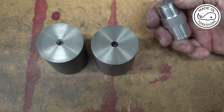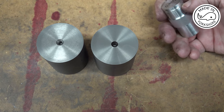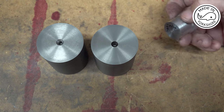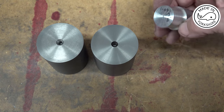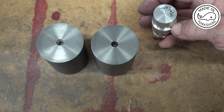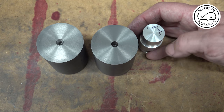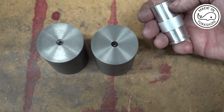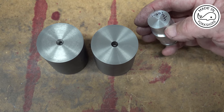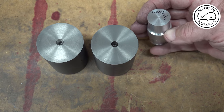So I've made a bit of a test piston here with a groove to fit the ring and I reckon I need to be aiming for the internal diameter of these cylinders to be 1.003, which will let me do a little bit of honing. So I've made this gauge here — the outside one's 1.001, then it goes 1.003 and then 1.005.